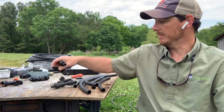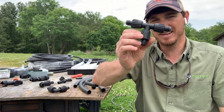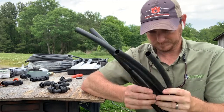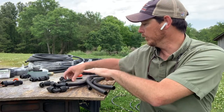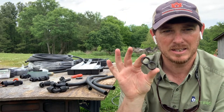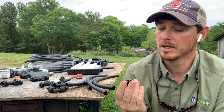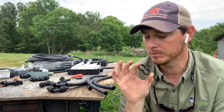I've got a couple of 90s, and I'm going to use a tee to get our water line into it. I've got some different pieces of tubing — these are pre-cut and short, more or less just to give you a representation of what we're doing. And then I've got this little end piece that goes on the end of the lines to cut off water flow to the pipes. Since these are open-ended pipes, we've got to crimp that so water doesn't just flow through. We'll look at how to put that together.